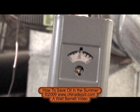This is a standard furnace hot water control. Right now it's set at 180 degrees Fahrenheit — that's for winter operation when you'd be using baseboard to heat your house. We're going to show you how to set this control down lower for the summertime, because in the summertime you don't need 180 degree hot water.